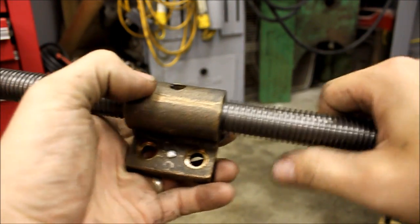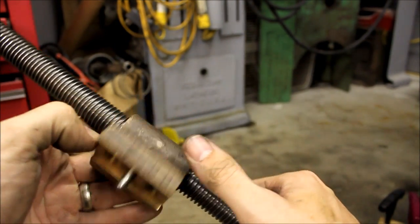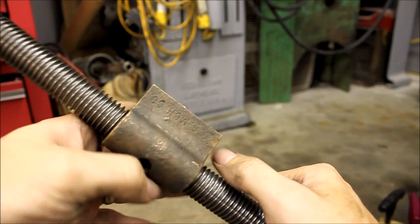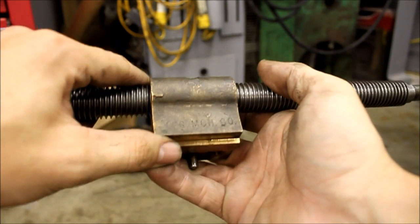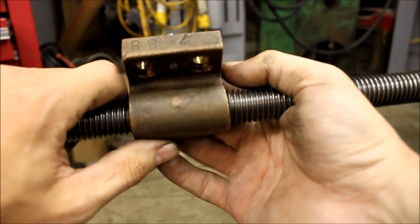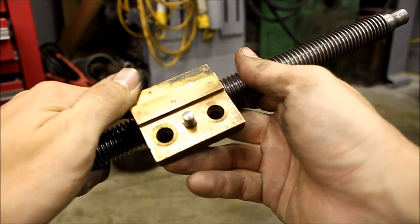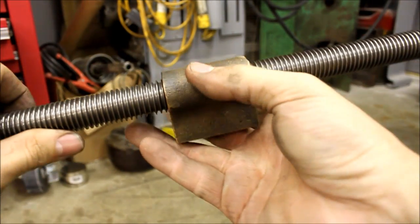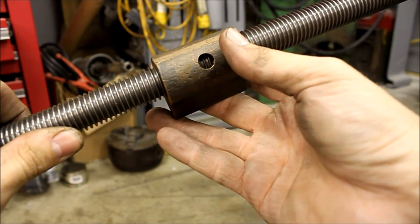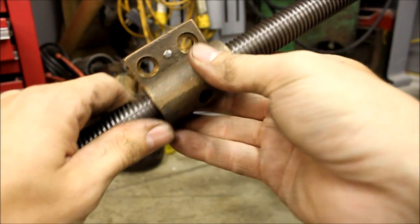After I've cleaned up the lead screw and the nut, I have to say this is a very golden colored material, so I'm assuming bronze. You can see here it's stamped GG Machine Company — George Gorton Machine Company. I've got it here towards the center of the screw where the wear is the worst, and you can see there's just a ton of play. It's really bad.